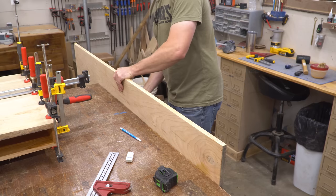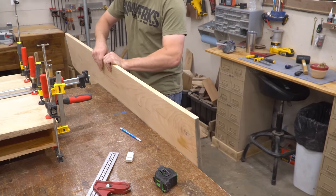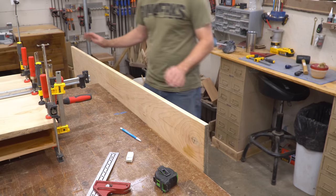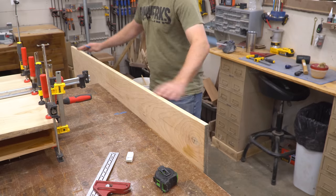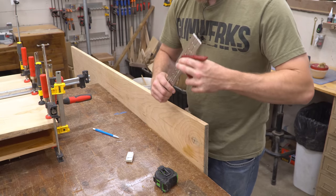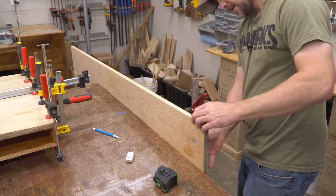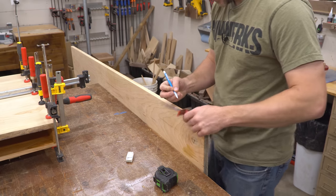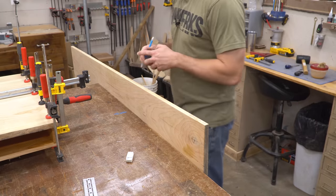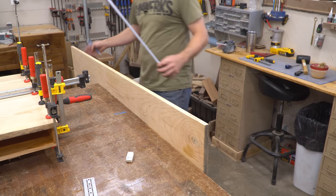While the big glue-up is going, I'm going to start working on the cubby that's going to go as a shelf above it. This is also a live edge that I've kind of squared the back end up on. I'm going to clamp it here in this vise so I can start marking it up. This is perfectly flat and straight and perpendicular, so I have a pretty good reference point. I want to use as much of it as I can to make it as high as I can, but I'm not going to have this knot be involved — I don't want to see it. So I'm just going to figure out where that knot is. There's the knot. So if we go there to there, I know I have to stop at that line when I'm doing my measuring. I think I want the cubby to be roughly six inches tall, and we can shorten the legs later.